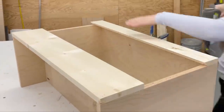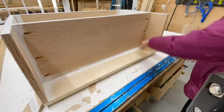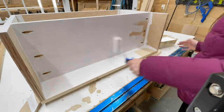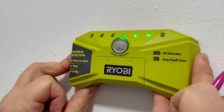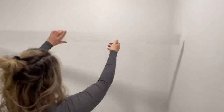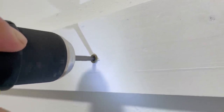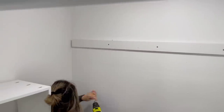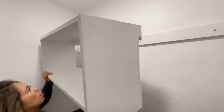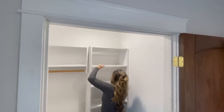I stapled it on with glue — you can also use one-and-five-eighths inch trim screws. After that, I painted everything with a brush-and-roll method. Now it's time to install it in the closet, so I marked the studs in the wall at about the location I want to hang the French cleat. I put one screw into a stud using three-inch long self-tapping star-bit screws, then leveled up the French cleat, finished screwing into the studs, and hung my components on the French cleat.